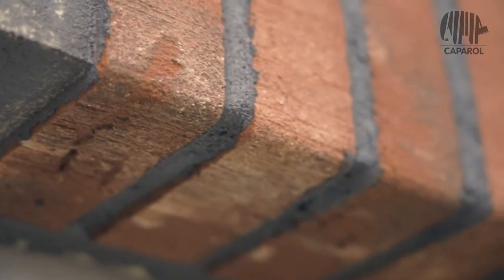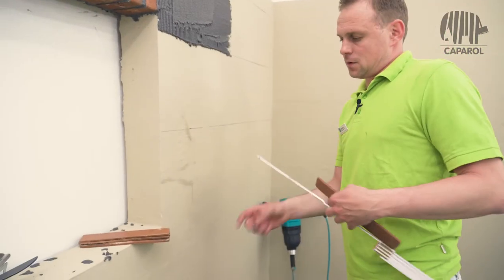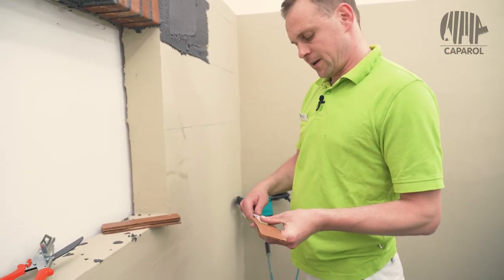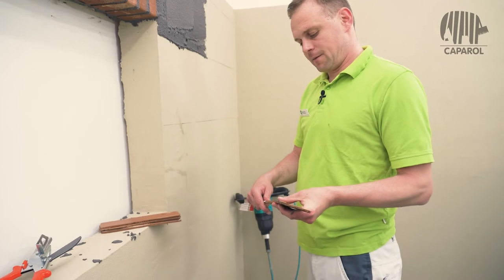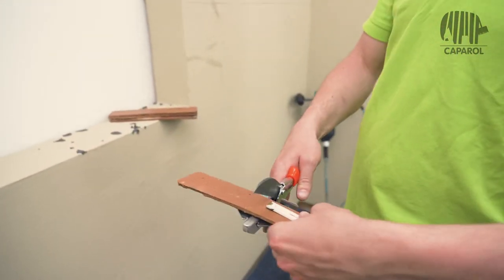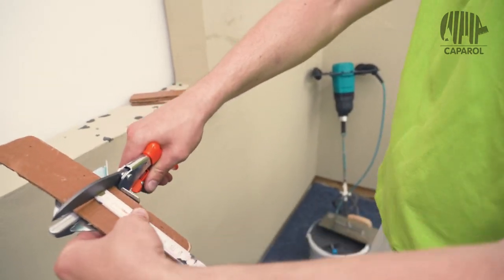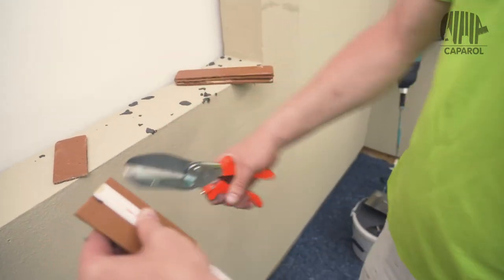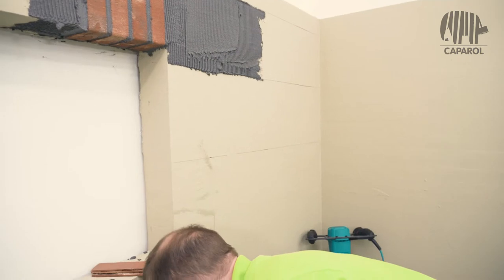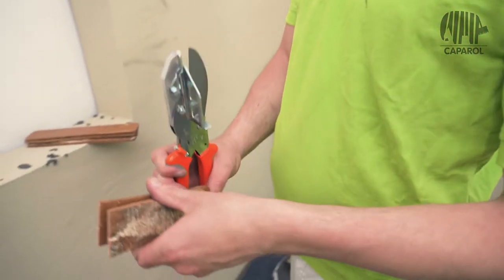If this has been done, the next step is the facade. For laying on the facade, as already seen, the Meldorfer headers can be made very easily with the Meldorfer angle cutter. The Meldorfer headers are half stones, which have a length of 11.5 centimeters, not 12 centimeters, which would actually be half of 24 centimeters, because you still have to cut out the 1 centimeter joint.